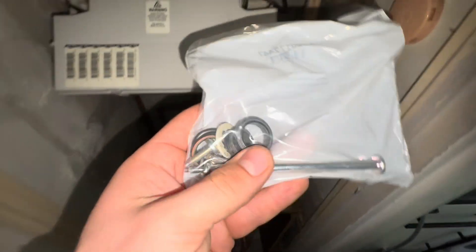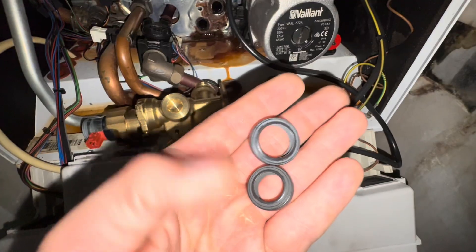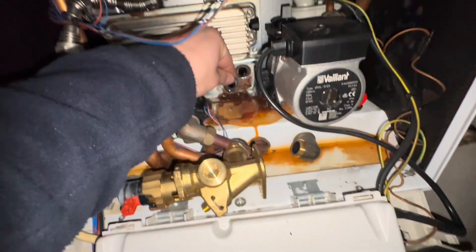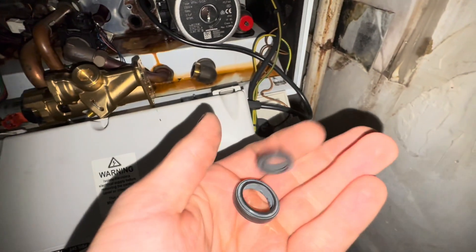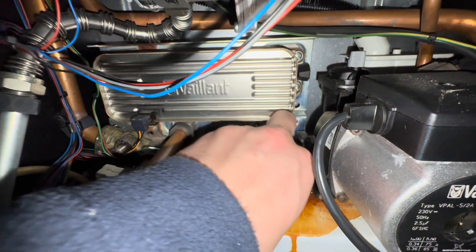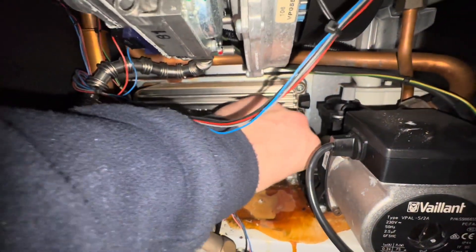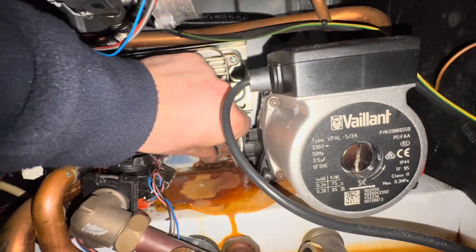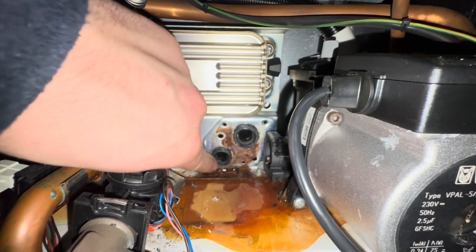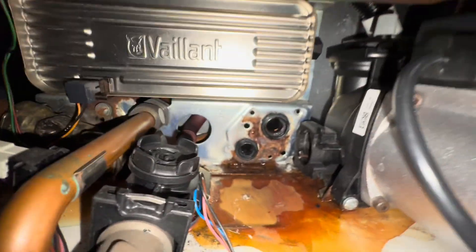Here's the new one. This is good stuff — there's a long screw for the bottom, you'll see that in a minute. First thing when fitting the new valve: get the new rubbers and lube them up. I would highly recommend lubing them up because it keeps them in place, otherwise they slip off and that's a whole lot of headache. Lube those up and put them in — one, two. They kind of just rest on there, they don't really pop in.